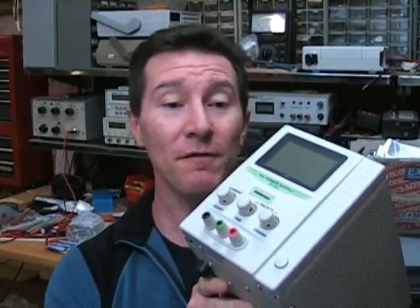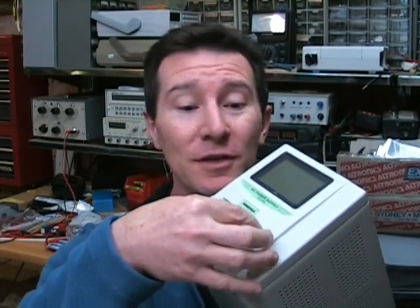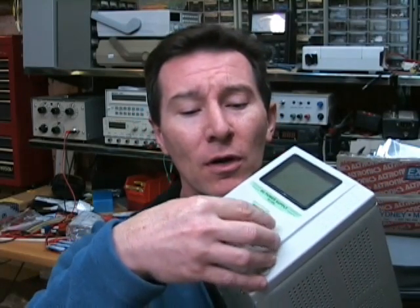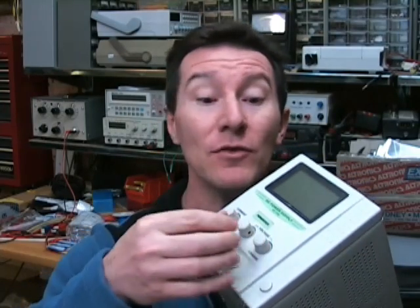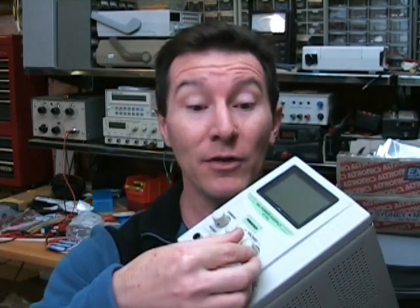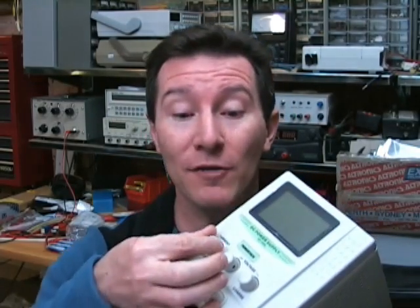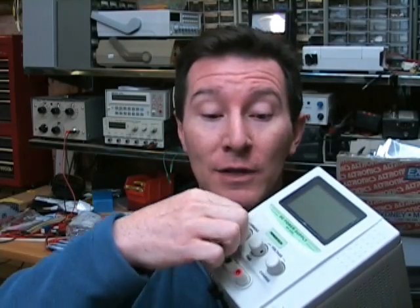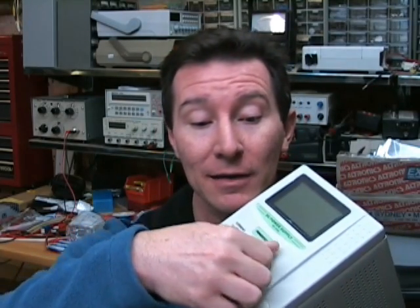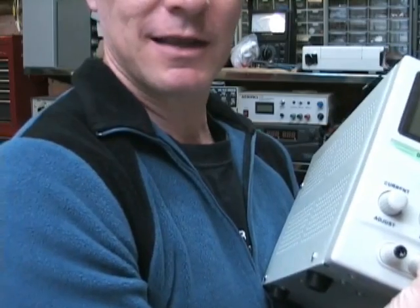A major thing I noticed straight away is that when you turn the knobs it's got a horrible noise to it and a weird feel — it almost feels like it's actually a wire-wound pot, but it's not. They're clearly carbon, because one of them has the standard feel and noise of a carbon pot. The other one is just a bit odd — I'll put up the mic here, see if you can hear this.